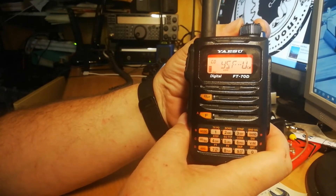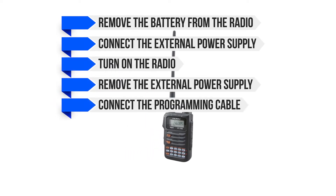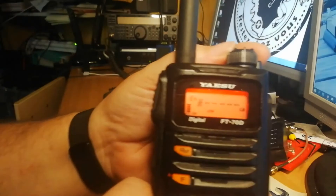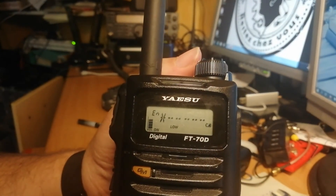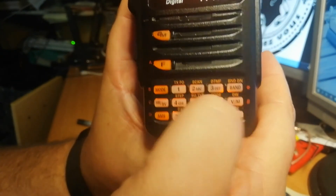Here's a quick rundown of the process: remove the battery from the radio, connect to external power supply, turn on the radio, remove the external power supply, connect the programming cable, press the AMS button and keep it pressed, connect the external power supply, then proceed with configuration. To be fair, there are radios with worse ways of handling programming, but Yaesu isn't quite supposed to have the same experience. So while it's still miles ahead of several similar radios, it is something of a disappointment in Yaesu's offerings.